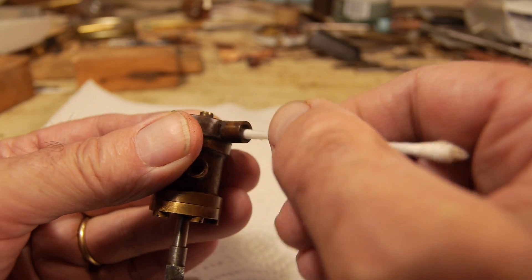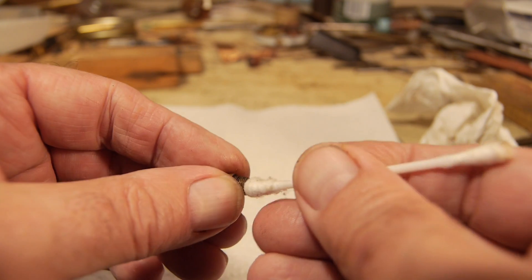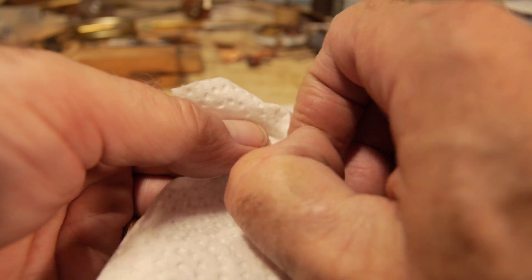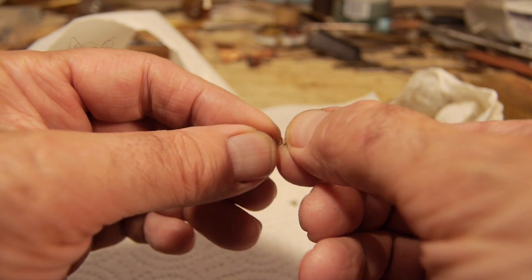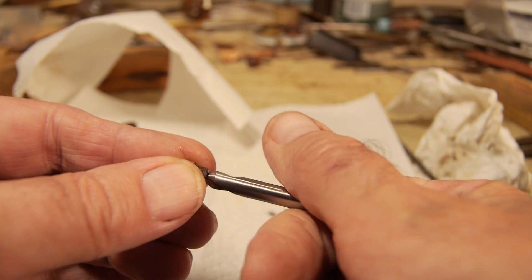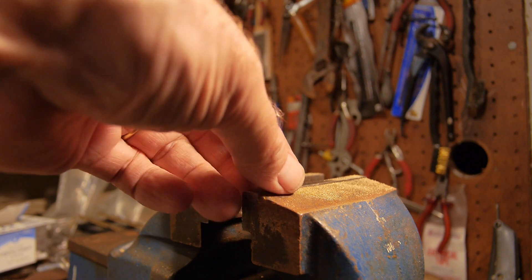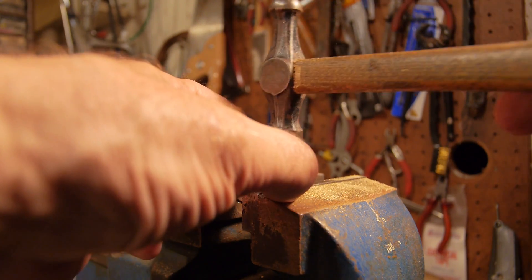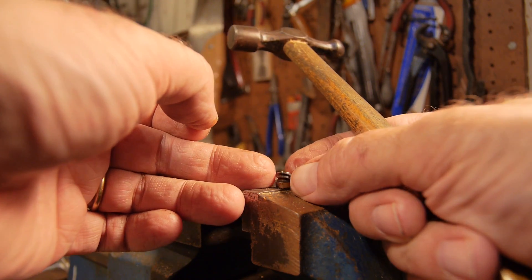First I'm going to clean this out with a cotton bud — it's actually pretty clean. This is the seating surface, and I think I need to do a bit of cleaning up of this. I'm giving the stainless steel ball a little bit of a clean. The spring looks to be okay. I'm going to use a center drill in my hand just to clean around on the seat. What I'm going to do then is hammer the ball into the fitting here to get the seat properly formed. One sharp hit should do it.